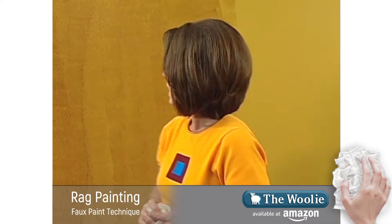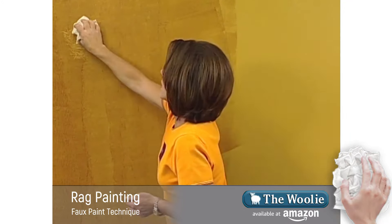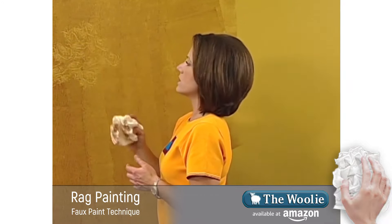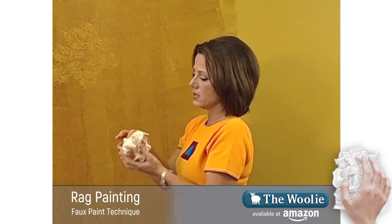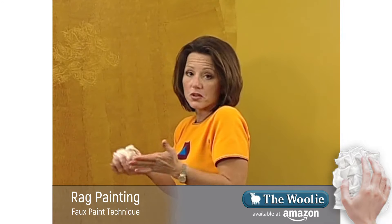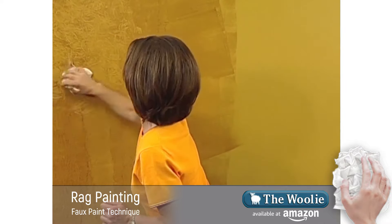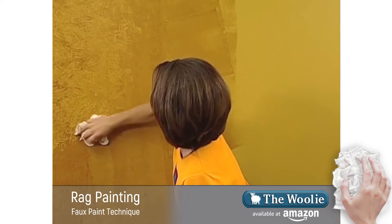I'm going to go ahead and start removing the glaze. I'll take my hand and begin by making an impression on the surface, then make sure I'm rotating — notice my hand is going right to left, back and forth, so that I have a rotational movement on the wall. At any given point if your rag becomes overly saturated with paint, refold it. You can keep doing this until your rag is completely saturated, then use a new rag. I'm rotating quickly back and forth — it's more of a pouncing effect — refolding, back and forth, creating my look.